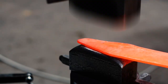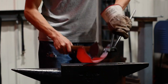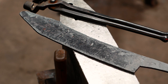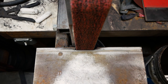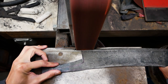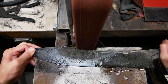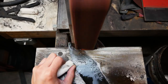Overall it's actually not too bad and I can work with what I've forged out — definitely not perfect, but good enough to profile the rest on the grinder. This part is pretty simple: just scribe the lines and then go at it with a slightly worn coarse ceramic belt. The slightly worn part is important because you don't want to waste a brand new belt on profiling — it just rips the abrasive right off. I'm using the edge of the belt a lot because less surface area means faster grinding. More surface area in contact when removing material means it's slower, but gives more stability.